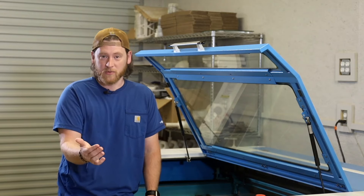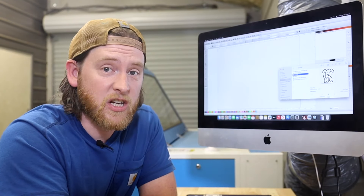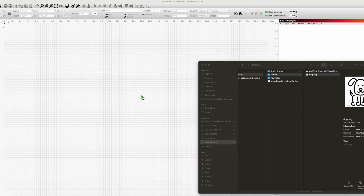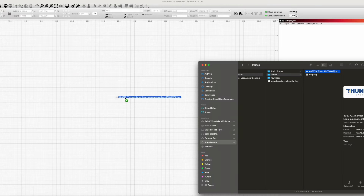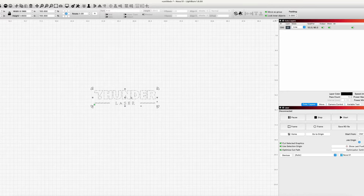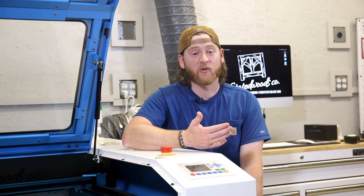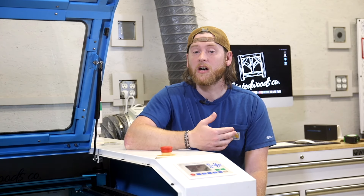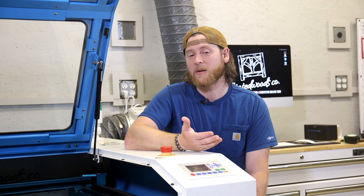You can bring in a JPEG, SVG, DXF — almost whatever format you want into Lightburn. If it's an SVG file or a file with vectors already, it's very simple. Vector files are basically the lines that the laser would follow to create the cut or engrave — think of it like an outline of your graphic. If you bring in a JPEG or a photo, you can do what we call image trace and it will create the vectors you want. Now what's really cool is you can purchase files or pull images online right into your software and get to cutting very easily. Always be careful of any copyright or licensing limitations before selling those items, but for personal use and non-profit, it's usually okay.